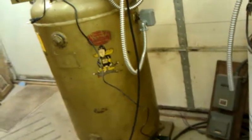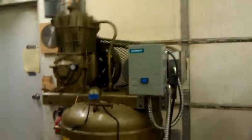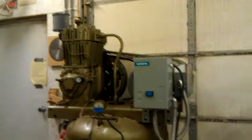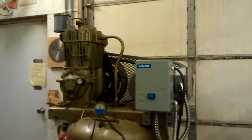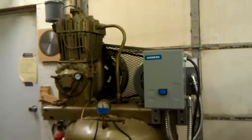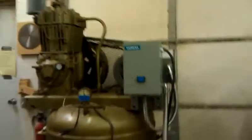Another thing is this compressor is in a remote location — it's in the same building as the shop, but in a different part. So going in to plug and unplug it every night is a real pain. If I tie into the bottom of the contactor, it'll never purge or cycle unless the compressor is running. I've got the capability of turning the compressor off at the circuit breaker on my side of the shop, so I can turn them both off with the flip of one switch.